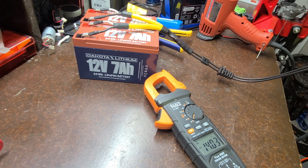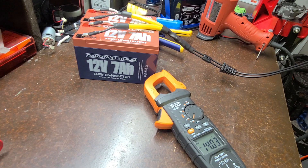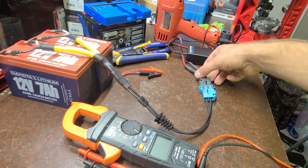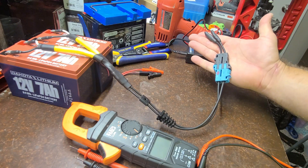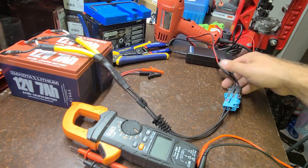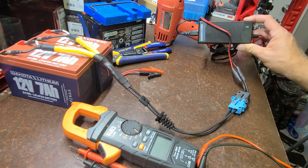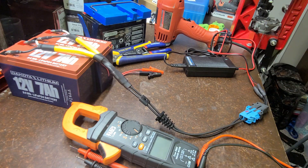There you can see we have 14.03 volts, so they're still fully charged at their resting voltage. I've got my connector added onto my lithium charger and as you can see they go right together. The charger is actually lit up green because it's taking in voltage from the batteries showing that they're charged, even though it's not plugged in. So we should be good to go.